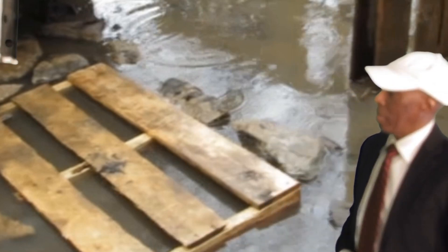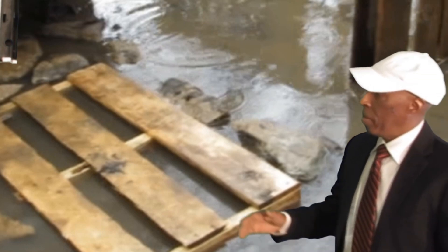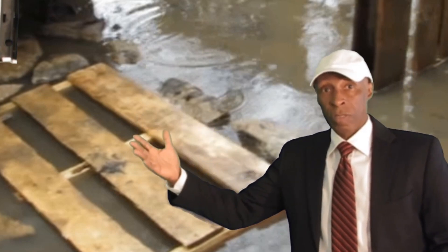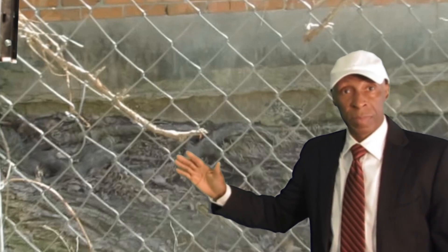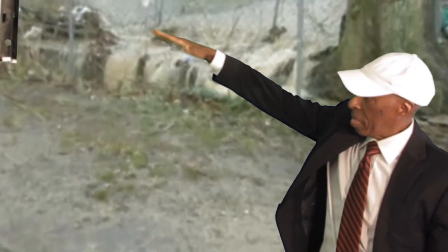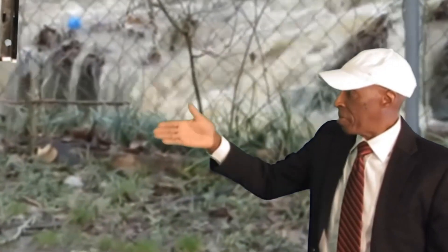This was not going to be an easy fix. What I found is there is a neighborhood drain that was actually dug out, going along behind some of the property for about a block. The property across on the other side of that drain — the foundation is being wiped out. So much water comes down because on the other block the property goes up a hill, and all of that water that collects on top of that hill comes down behind this house and it's wiping the foundation.